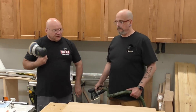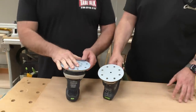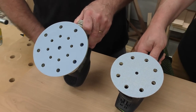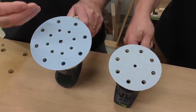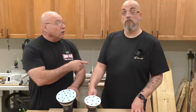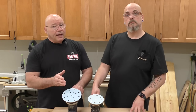Hey, why are you using a five inch sander? Because it's the one you gave me. So let's turn it over and look at these. This is a six inch sander. If I can coach anybody on a huge tip - if I'm sanding a big surface like this, a lot of people go the difference between a five and a six is one inch. It's not - this has 42% more surface area. So don't make that mistake and use a five inch for everything. Get a six inch sander for something like this and you'll save time.